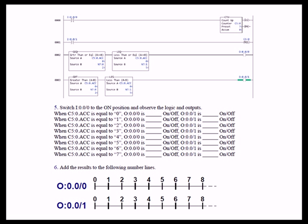To further emphasize the difference between comparison instructions with and without the or equal, we switch from a timer to a counter. A counter gives us more control because we can increment to 1 and stop until we toggle input 0 again. Switch 1, input 1 allows us to reset back to 0, so we can step through the comparison more slowly.